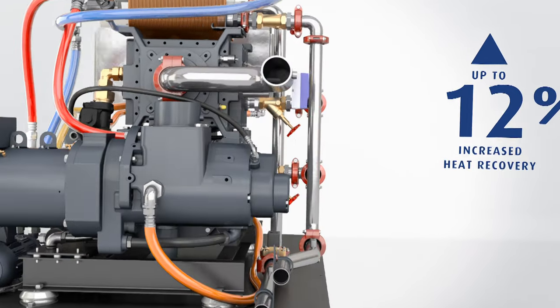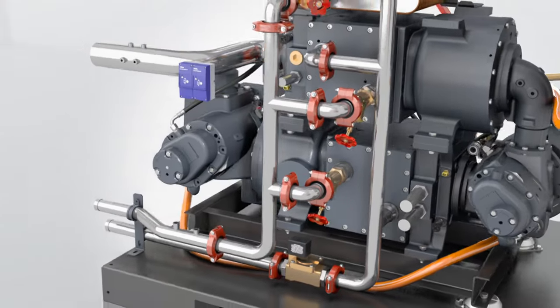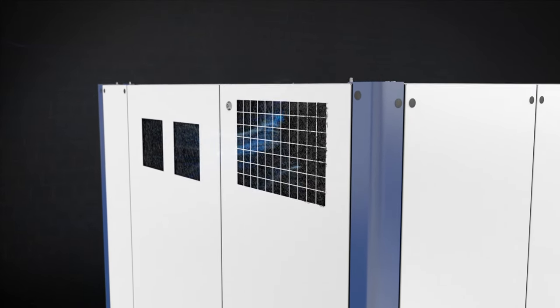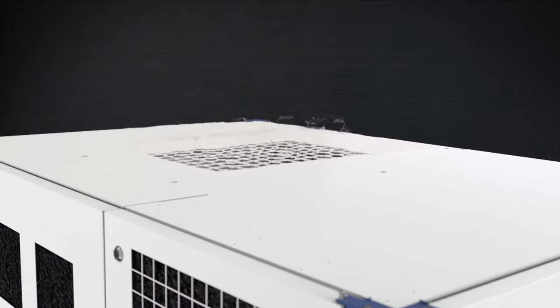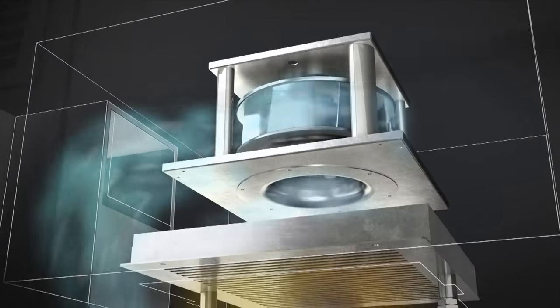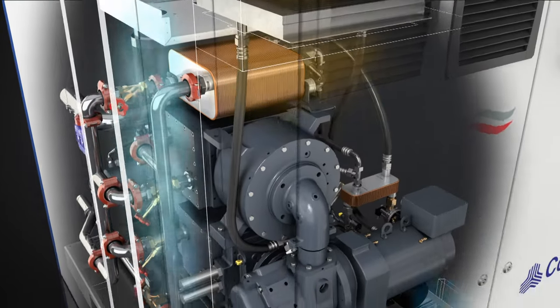We also collect heat independently from the first and second stages. We also wanted to extract heat from the ambient air inside the compressor's enclosure. For maximum efficiency, the air entering a compressor should be as cool and dense as possible, so it's a bad idea to release warm air directly into the compressor room. Ultima doesn't do this. Instead, it processes this warm air within its enclosure, extracting the heat with a heat exchanger. The cooled air is then ducted to the base for redistribution back into the compressor. As a result, heat isn't wasted and the inlet air from the compressor room stays cool.